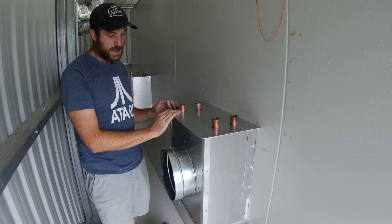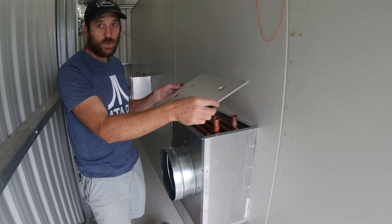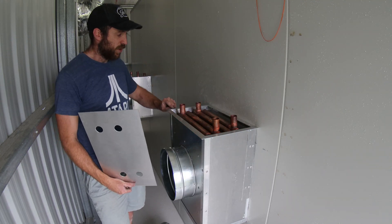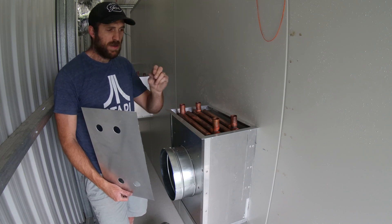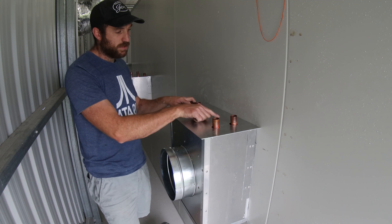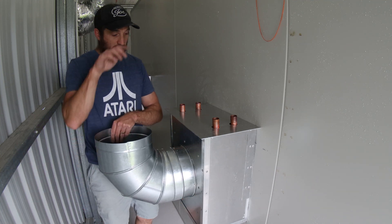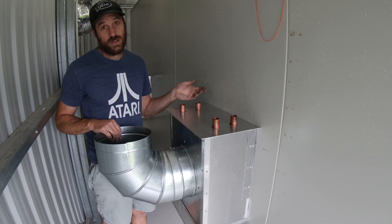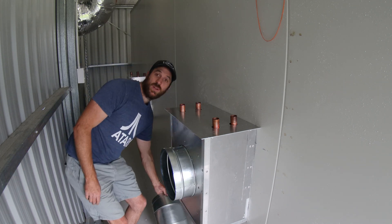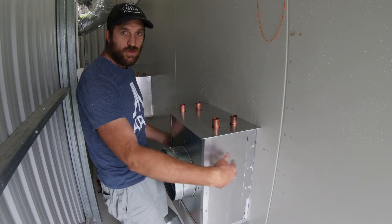I've worked most of the day to try and get this done, and it's looking pretty good. The heat exchanger is completely mounted inside here, with this removable lid which sits over the top, and it's got some holes for those copper pipes to come out. There's also a lip right around the edge where I'll put a foam seal or maybe a silicone seal, and basically this will sit on top with a small weight holding it down. I'll create some little seals just around these pipes and we should have this box completely sealed. So when that fan sucks air, it's going to rip it through those two heat exchangers in there. You can choose to run them or not — it is optional. I still need to seal it, get in there with silicone and seal all the edges so there's no air permeation through any of these cracks.